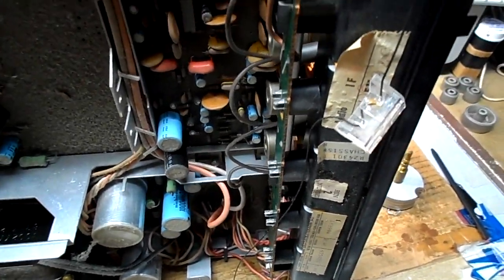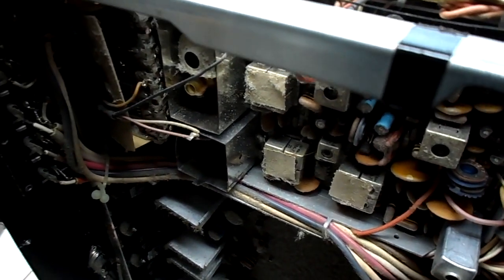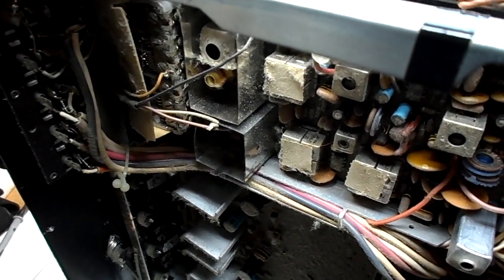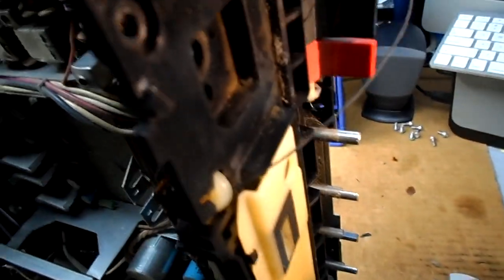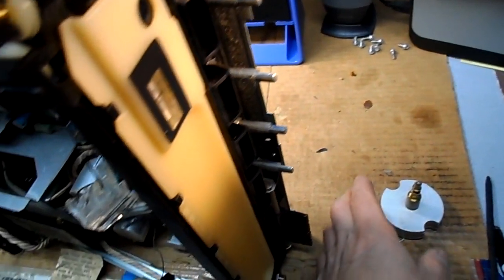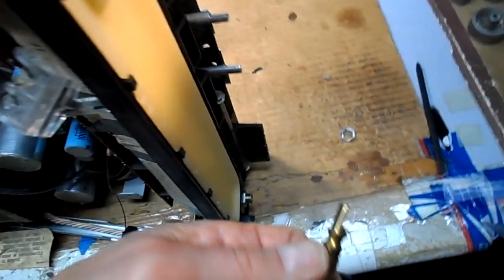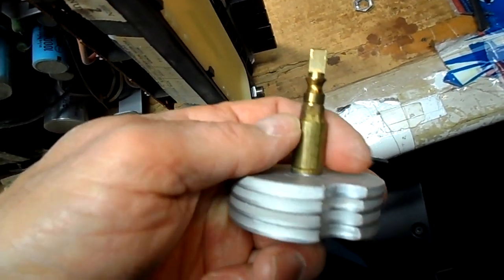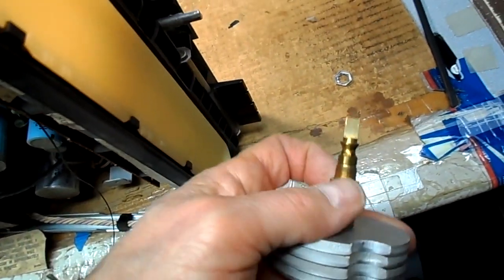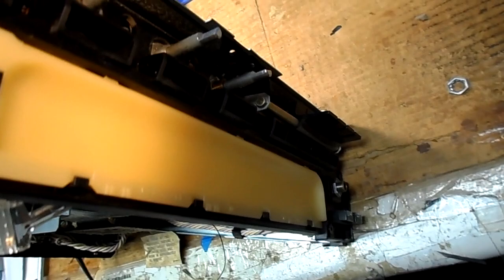So what I've done so far is walk it back to closing the plates. I've closed the plates. We'll set the pointer at the top and we'll try to restring this. The string is not broken. The problem is the counterweight here, the weighted tuning, the brass here, it's all gummed up, which caused the nut to get loose, and it just went downhill from there, whoever owned this.